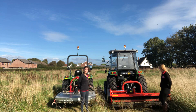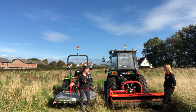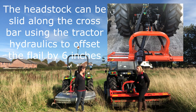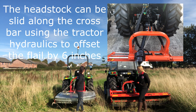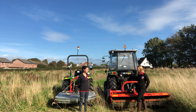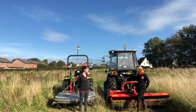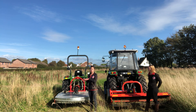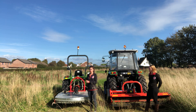A feature of the toppers is that by changing your headstock you can have it covering a wheel or have it more offset. We can do that on the flail mowers as well — on the flail mowers it's done by the hydraulics, so you get two hydraulic pipes which go to the double-acting spool valve on your tractor. That allows it to be offset against the wheel, which is great for getting into hedgerows or if you've got an orchard and want to get close up to your trees. There's a similar function on the topper — this curve has been specifically designed so you can get really close around the corners.